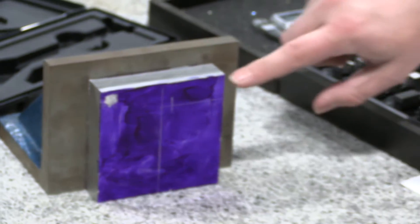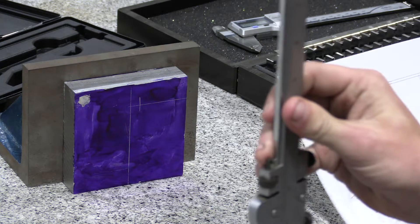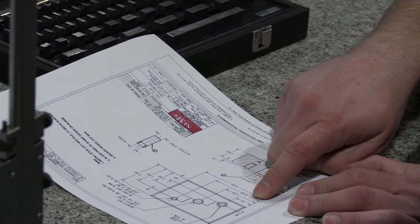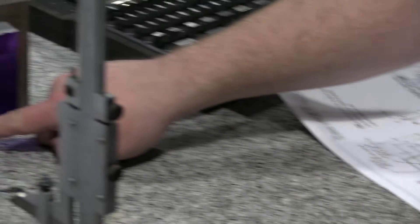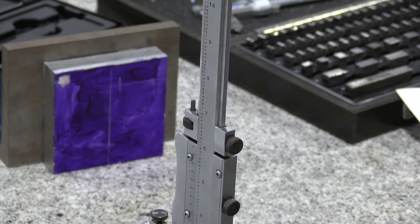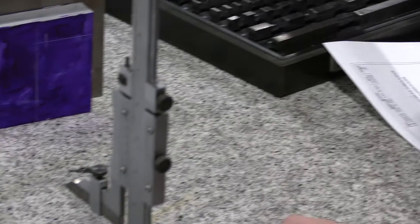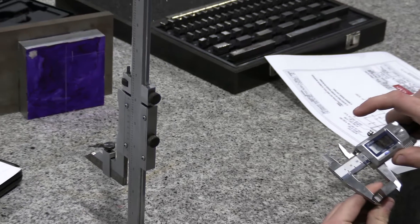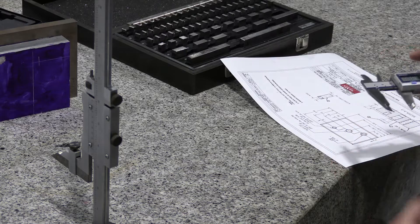So ultimately when you're done, we're going to saw-cut this material off and save it for another day. We'll mill this part off and you'll have a two-by-three. While we're in this orientation, let's go ahead and set our vertical intersects — we're looking at three-quarter, inch and a half, and two and a quarter. We're going to scribe three lines; start just a little past and go each one so you don't get confused. Something important when you're first starting to use gauge blocks is to make sure you have calipers handy to check the orientation of your gauge block until you're more accustomed to using it.